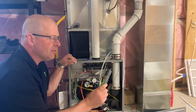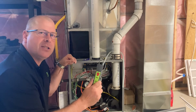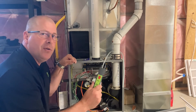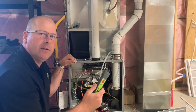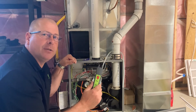This manometer has a range of up to 60 inches, and like all TPI manometers, it is temperature compensated. That means it's going to maintain its accuracy from 32 to 104 degrees Fahrenheit, or 0 to 40 degrees Celsius. So whether you're on a rooftop unit in the heat of summer or in colder weather, it's going to maintain its accuracy.